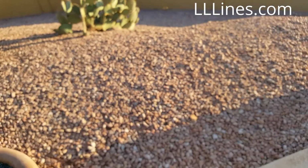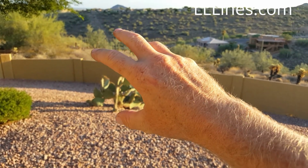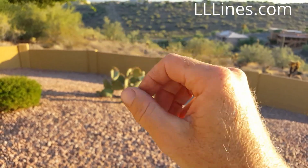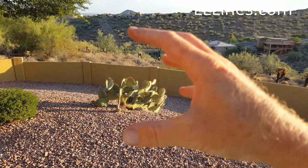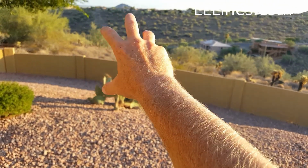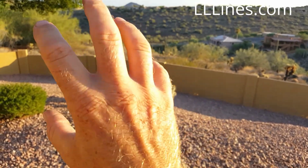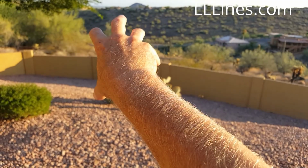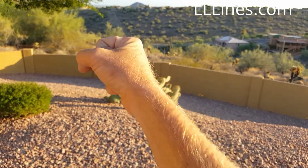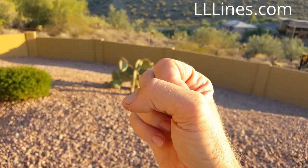The best example that's been explained to me is, just imagine you have a cobweb. These would be your standard filter cartridges on the market that have the fiberglass or fiber weaves, just the random weaves. The wind is our water flow. The paper airplane is our debris. The paper airplane flies into this cobweb, this random pattern of webbing, and it gets hung up. Now, as more and more debris goes in there, the wind has trouble penetrating and going through that web. Then when the wind stops, which would be your water flow, and you want to remove that debris, you're pulling on it and it's all hung up in the web and you're wrecking the web.